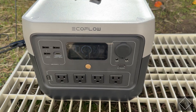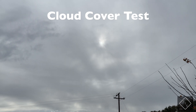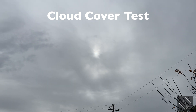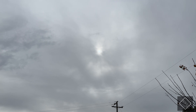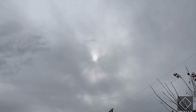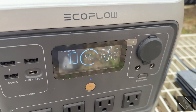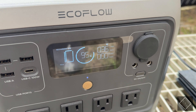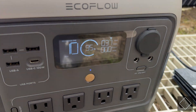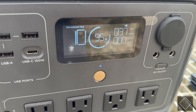Here's the sky — you can see it is nearly 100% cloud cover, probably around 95%. The sun is just peeking through the clouds there in the middle of the screen. Looking down at the display, the 220 watt panel is currently bringing in only 36 to 37 watts of total power under those cloudy conditions.